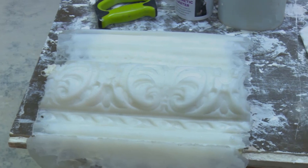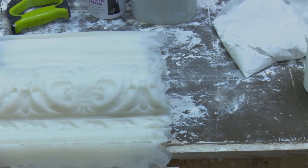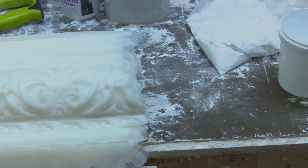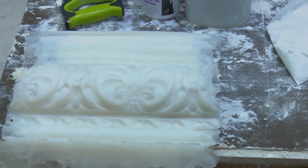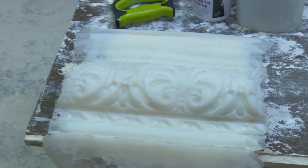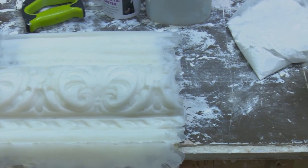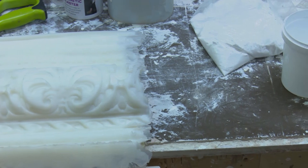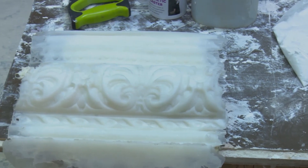You can now take that back to the workshop. You have enough of a repeat pattern there to replicate that over and over, join those together, and actually make a complete length of cornice from what you have there. Any defects on the surface can be remedied in the workshop; however, the profile and all of the other details are extremely difficult to model onto a bench. Thanks for watching — now let's go to the workshop and I'll see you on the next video.